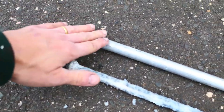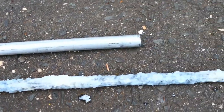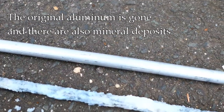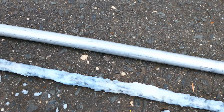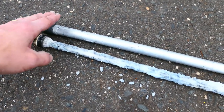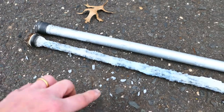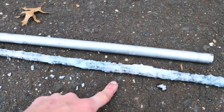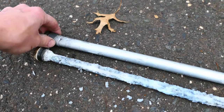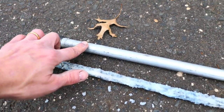I took this outside where we can get a better look. So this is the new one, and this is the original — and I think this is definitely original. It's just coated in deposits. It's definitely time for a new one. The new one is quite a bit shorter, so it won't provide as long protection because there's just not as much there. The reason they made it shorter is the ceiling clearance issue. Some third-party ones are folded — you have a section, then a little hinge, then another section — so you can twist it in. This one is actually specified by the manufacturer: it's A.O. Smith. But being shorter, you'd just need to change it more often.